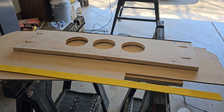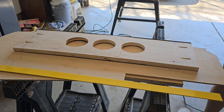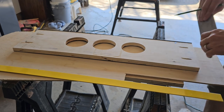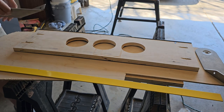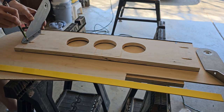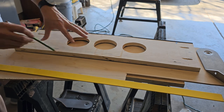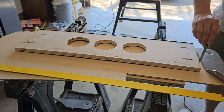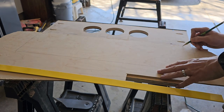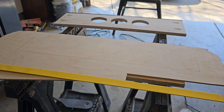The problem I had was that the mounting hinges don't have enough of a gap to mount in the traditional outer manner. My first thought was to shave down the hinges, but this wouldn't have been enough as the gap was less than three quarters of an inch on each side. I noticed I had some scrap wood close to the dimensions of the carriage bolt head — mounted flush with the hinges it's about five millimeters. I measured out the scrap wood and turned it into a shim that will eventually hide the five millimeter gap between the cabinet and the back box. I lined up the hinges on the back box bottom panel so there was a quarter inch gap, marked out where the holes should be, then lined up the bottom panel with the scrap and made the cut.